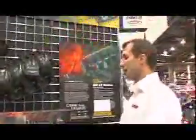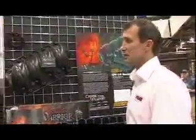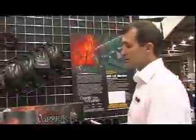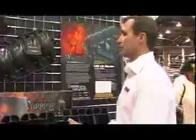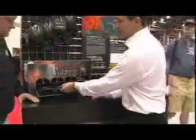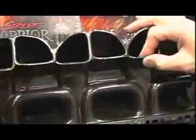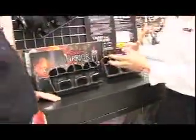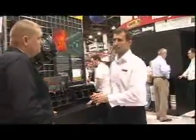Sure. Now, not only that, we've also incorporated into our manufacturing process a new technology, which is what we like to call the thick and thin technology. Now, this has been unavailable in aluminium and plastic manufacturing previously. As you notice here, we've got a half inch thick bell mouth trumpet, and yet we've got a 3 mil wall thickness up here. Traditional injection molding would have that pull and twist and stress and possibly fracture. With our technology, this is not a problem.